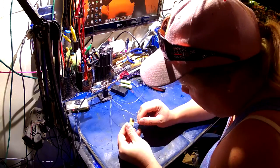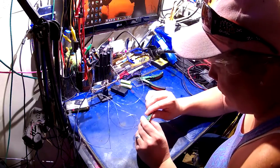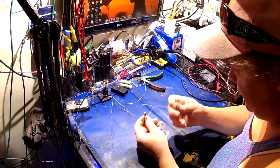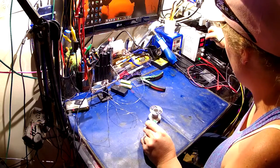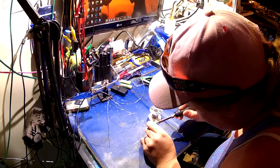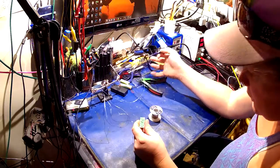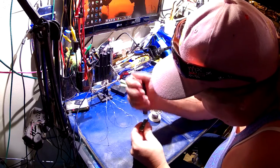Let's solder our little wires on here. I'm going to stick these into these LED markers. If you want to laugh at me for not remembering my diode polarity, go for it. We need some solder. Oh, I'm so sick. Let's retin this — throw a little bit of solder on there. Yes, I use flux. I like flux. Flux makes everything so pretty and you always know that it adheres well. I'm going to get my toenail clippers here and trim these guys off. The whole board should have been trimmed but nobody ever trimmed the legs off of these components. That'll be a lot tidier.